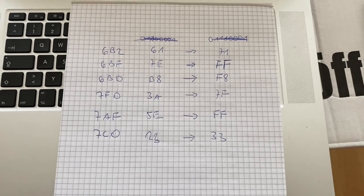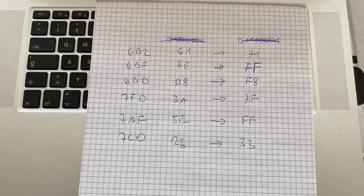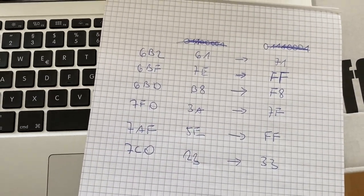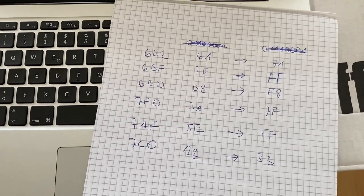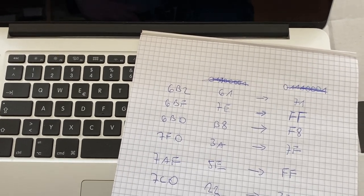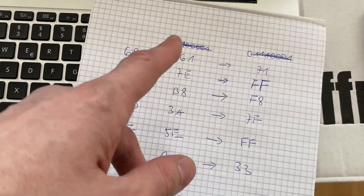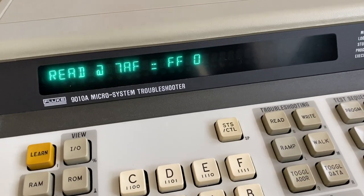On first glance, I would say this should be the problem of a damaged or non-working EEPROM chip. But we tested it in our reader, and we got this data out of the EEPROM reader from the very same chip, and we compared it with the main source, and everything is fine. So in the EEPROM reader, the EEPROM outputs these values correctly. So it is very likely that we have some sort of data bus problem on the board, where sometimes intermittently there are disturbances on the bus, or some signal problems, which lead the data being transferred to the CPU to have some bits pulled high which shouldn't have been pulled high. Okay, so this is getting really challenging here.